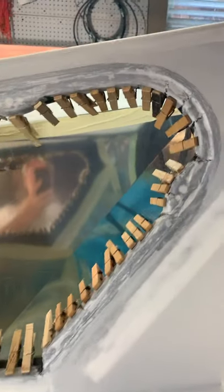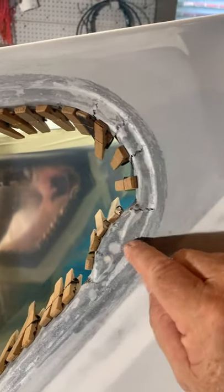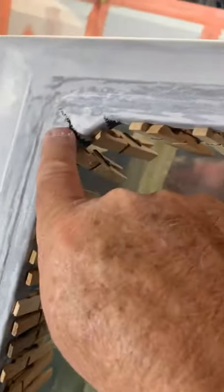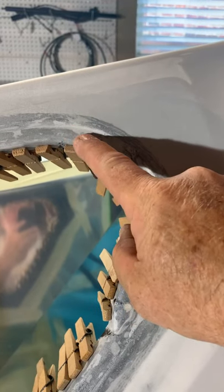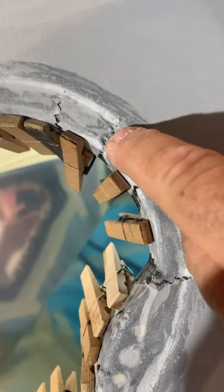When you go in here, you'll have to cut these radiuses all the way in to the dip where the door will set into the recessed area. These are quarter-turn receptacles here. In these areas, if you don't cut them, the fabric will not lay down in the receptacle — it will want to pop up. So go ahead and cut it all the way up to the receptacle in several areas to make sure this lays down.